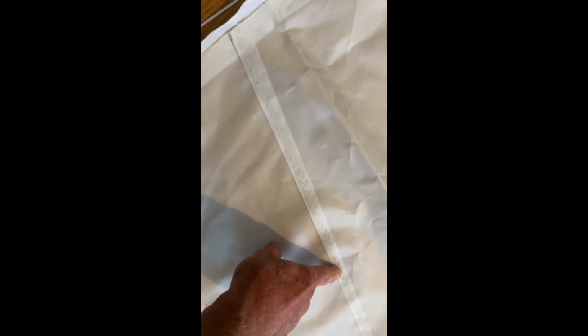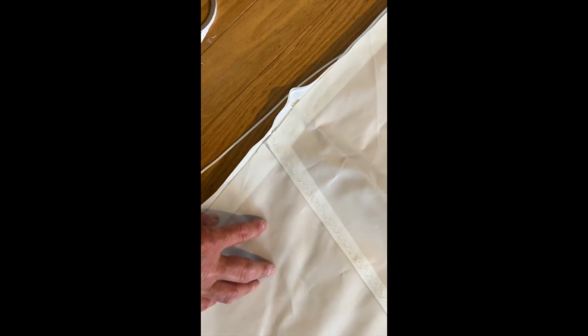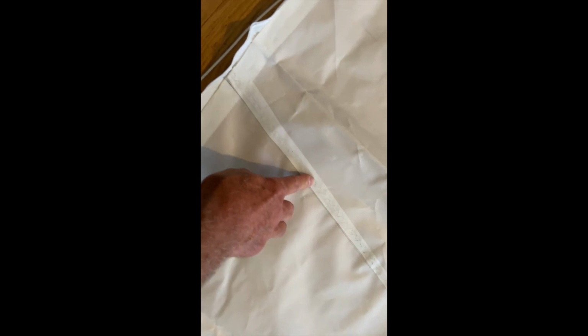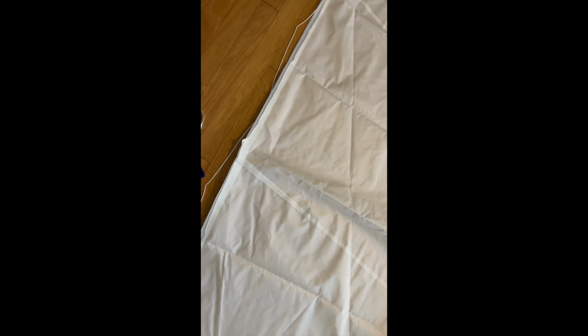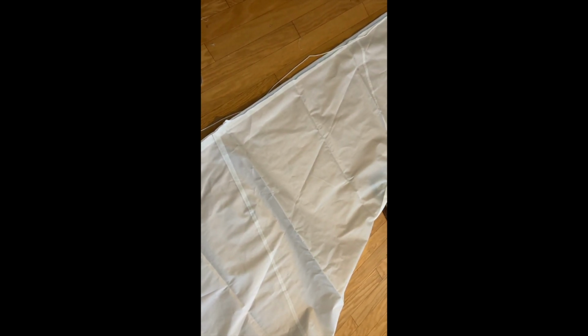And it's going to be hard to see, I'm sure, but right here, I started and I cut out the threads and I put about a 3/8 inch dart. In other words, I took this panel and pulled it this way, 3/8 of an inch here to nothing out here, just to pull that together a little bit to get rid of a little bit of that belly that was out here on that leech edge from cutting out so much of the sail. And I went ahead and did it now before I tape it all together and sew it, just to make it a little bit easier.